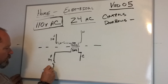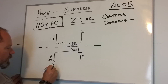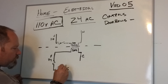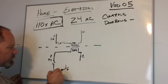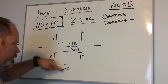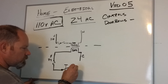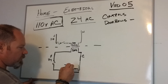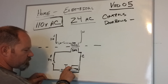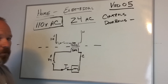Now we're going to run it over to a switch — and this fuse could be built right into the transformer, or it could be a breaker you reset. So now what we're going to do is run this all the way over to a switch. Except this time the switch is going to be a push button — normally open. And then we go on to our coil and back. This is our doorbell. This coil could be connected to a magnetic ram rod, so every time you complete the circuit the rod goes ding, then you let off and it goes dong — ding dong. This is exactly what a doorbell circuit looks like in your house.